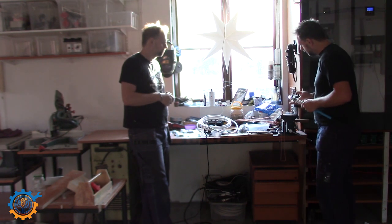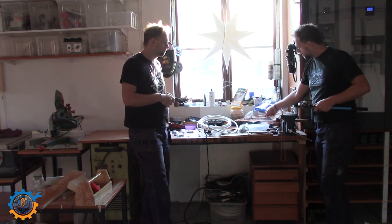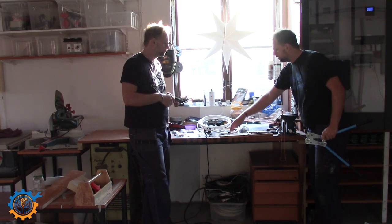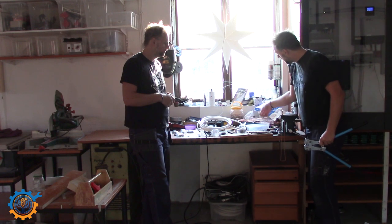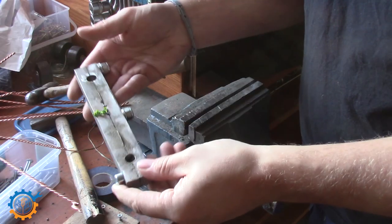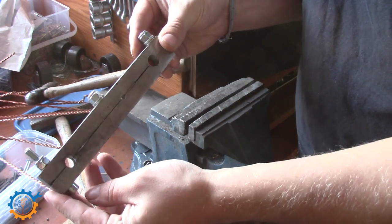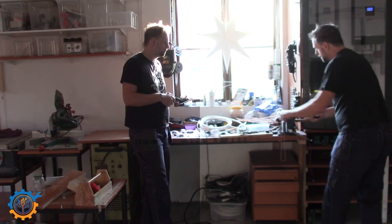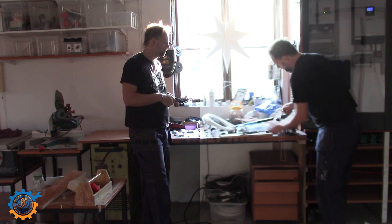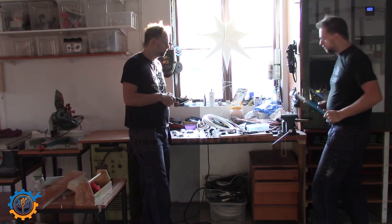Yeah. So basically what I'm doing here is that I'm crimping the lugs onto the bus bar, and the bus bar is connected or created with basically 2.5 square millimeter cable or wire from household. So bare copper wire, and to shave them off I'm using this tool here that I have showed before. So let's crimp this one for now. And of course a proper crimping tool is needed if you're going to crimp onto it. And this tool does the job very, very good.